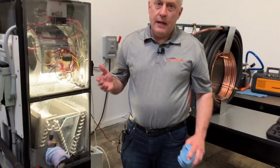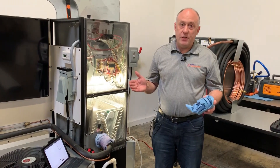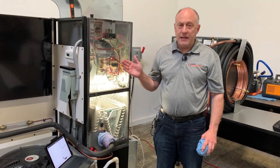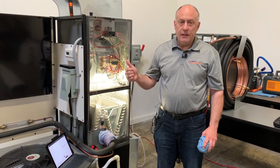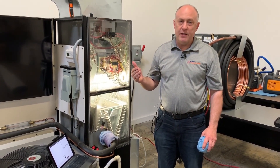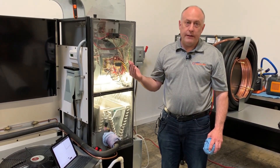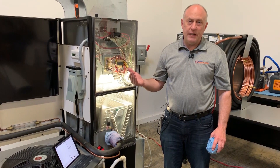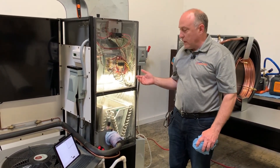What we're showing here is an actual increase in efficiency of the system, and we can quantify that increase with an electrical savings. You can't do this with a normal amp meter, because it simply doesn't make all the measurements you need. You actually need true power in watts or kilowatts — and that's what the Redfish meter does. It measures power, volts, amps, and power factor, so we can get a true reading of system efficiency and show that to our customer.